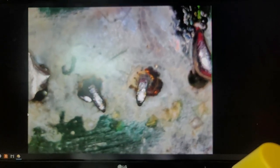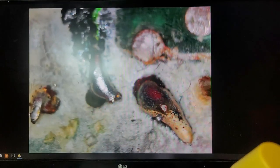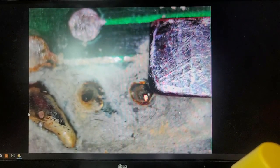Okay, where's the next ugly one? Yes. This is the next ugly one. Let me rotate that so it goes in the right direction here. Yes, that's lovely. What the heck were they doing? That is messed up. It's missing solder mask, everything. And it looks like the trace is almost missed. Unless there's just crap on it. Yeah, that might just be crap.